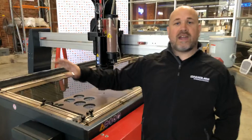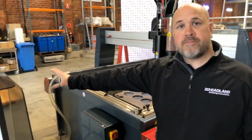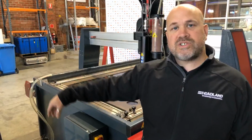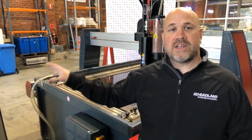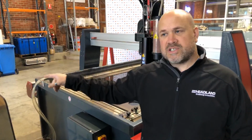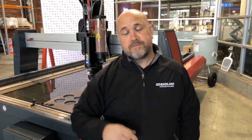In addition to that, we have the Enduramax pump on this one. This is Omax's premium pump. It has up to 800 hours of maintenance life between your required seal changes and runs at 60,000 psi. So, fantastic pump. It's the latest innovation in pump technology from Omax. Again, we'll take you through that in a bit more detail in a minute. If you've got any questions through any of this, please feel free to type in the comment section below, and I'll do my best to answer them.